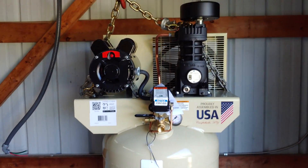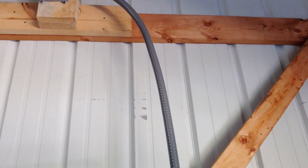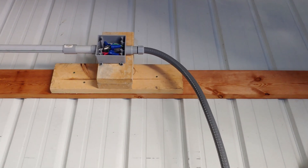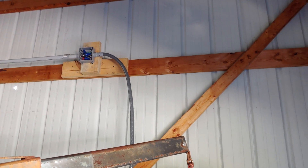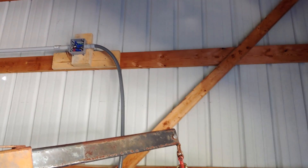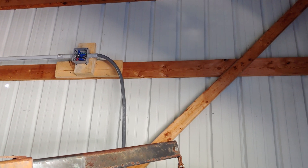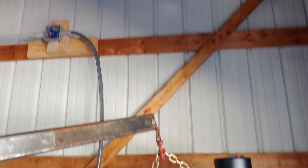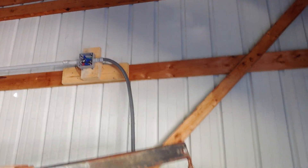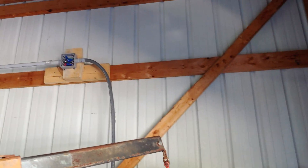Basically, you run the wire into a six-foot whip into a junction box, then in conduit to the sub-panel. It's a 50-foot run. Number 6 wire is oversized — a lot of people will say you can get away with 10, but I wouldn't feel comfortable with 10. I would feel comfortable with 8. Number 8 is what's in that whip, but I put in sixes. I also put in three conductors plus a ground — I should specify: the neutral conductor gives you 120 volts relative to either hot leg.